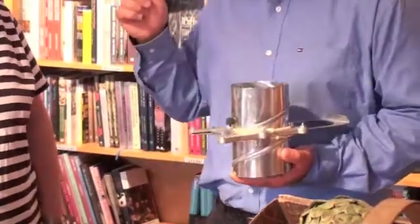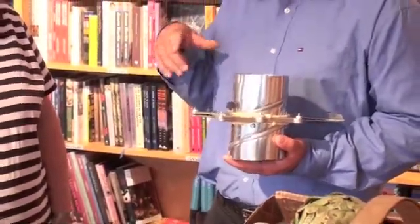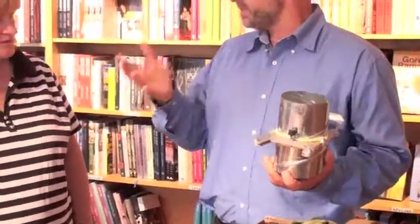Now, in a cellar, in order to get complete circulation through, say, a basement cellar, something you can walk into, you need to have two vents. One ends near the ceiling, and the other would be connected to a pipe that would end near the floor, so you get this circulation through. You don't want pockets of extra high humidity; you want it to be more or less even. And that's a way of encouraging air circulation.